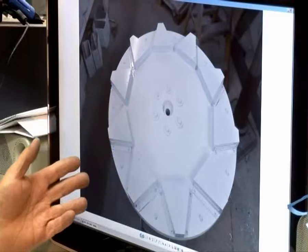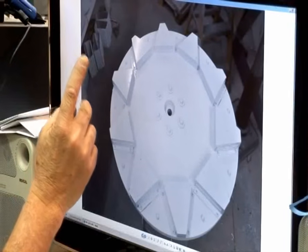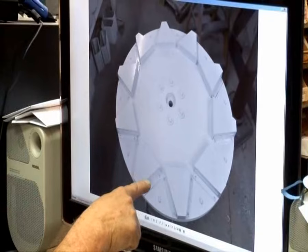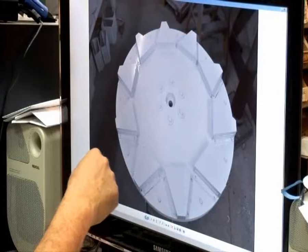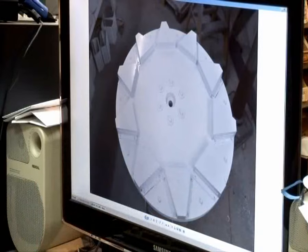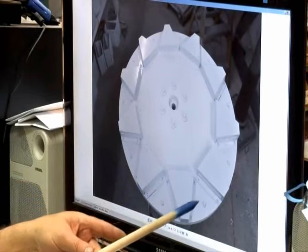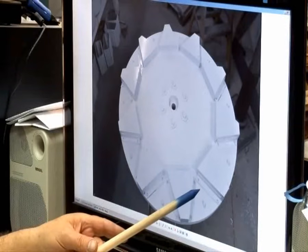So instead of letting these magnetic fields ride out in a loop fashion, we make the lines go through the iron straight, but at this angle. Notice the angle. It's a wider V than this V, because we don't want quite the same strength out here that we want in here. So what we're actually doing here is we're causing the magnet to be nonlinear.